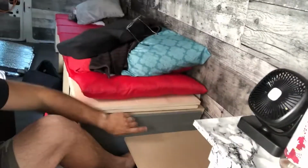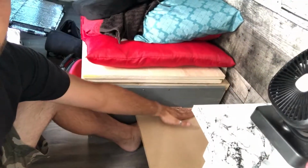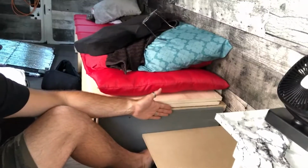And I also have space under it, which I'm going to keep emergency food supplies and the first aid kit and stuff like that. It's not being supported against a piece of plywood, right? So I need to get a little 2x2, cut a section about this big, attached to the plywood underneath the MDF board. So there's a brace, and then that'll give us the structure on this side that will hold this platform up, and then build another wall here.